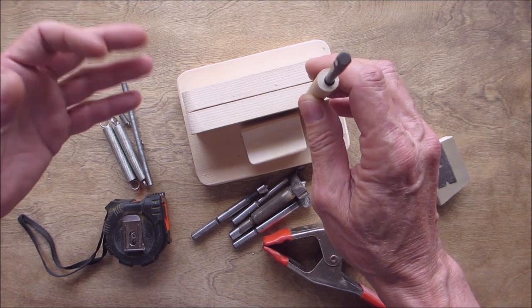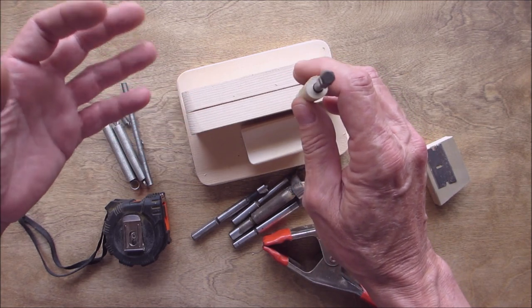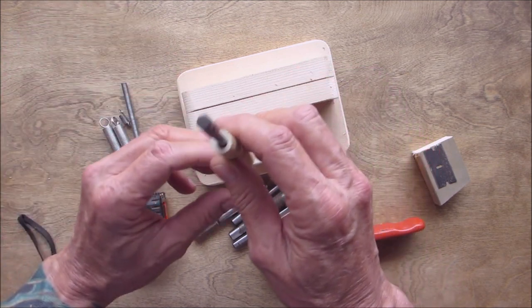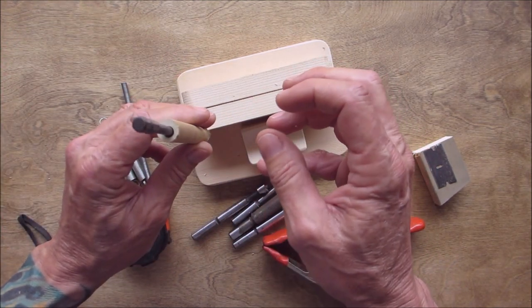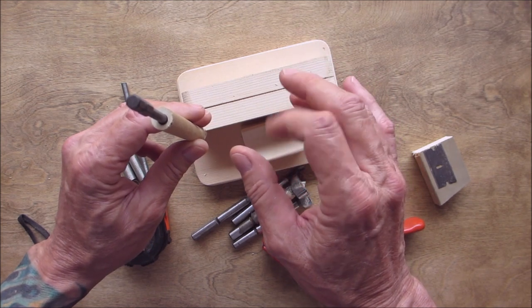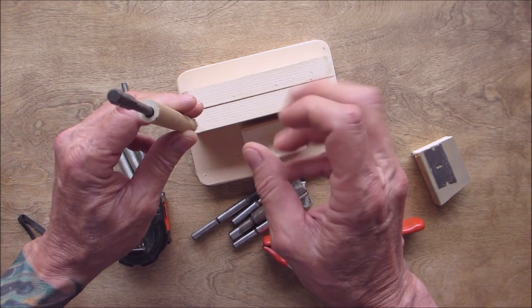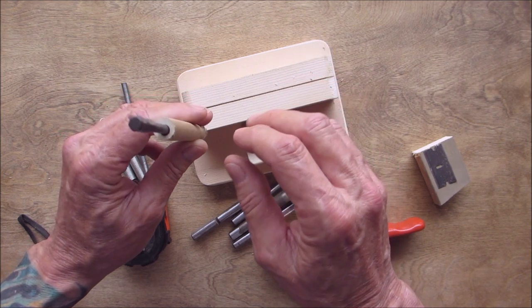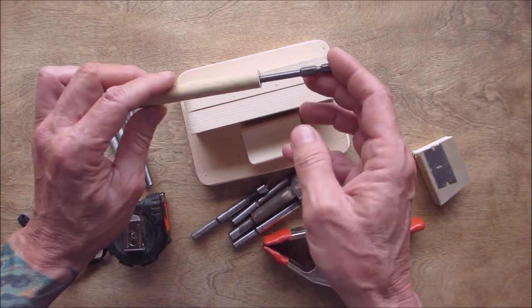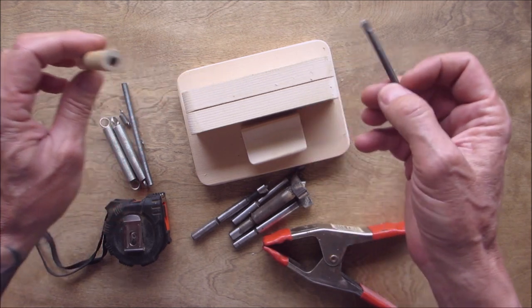Like if I'm making a handle for a ferro rod, or putting epoxy in a tang for a knife or something. I use that G-Flex epoxy, and it's got a pretty long pot life, I think around 45 minutes, and it takes like 3 or 4 hours to get that initial cure. And during that time, if this is down in this position, it's going to leak out, and I don't want that.